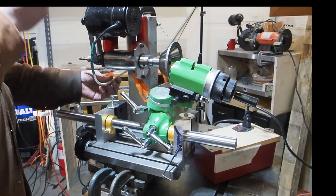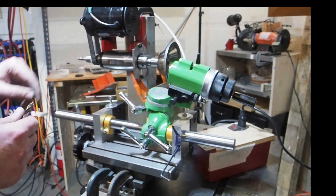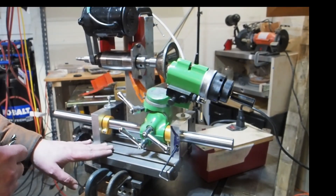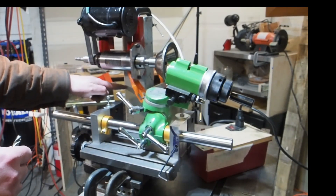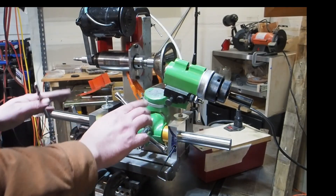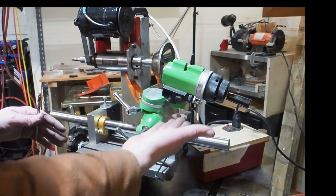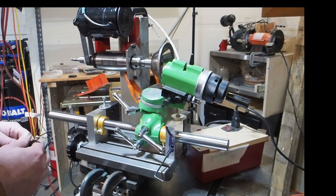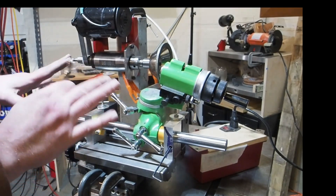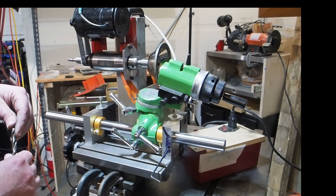The motor's working fine. The location of the switch was definitely a problem - I have to reroute this control box, maybe use a longer piece of wire. I really need to have a high level of comfort before I attempt to weld up a frame. I'm going to weld it up out of some square tube, and I may actually use a piece of four-inch by quarter-inch steel tubing for the wheel. I'd like to see if there's a way I can have a table that runs underneath here, maybe on a rack and pinion, as a much simpler grinding table, maybe even to do some really rudimentary and very light surface grinding on some very small parts.